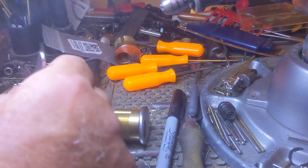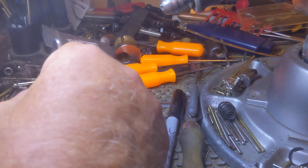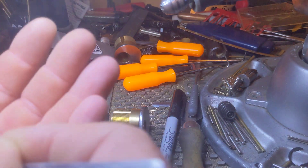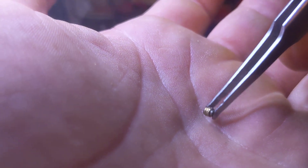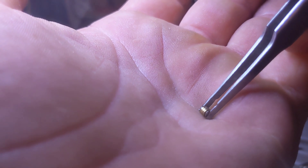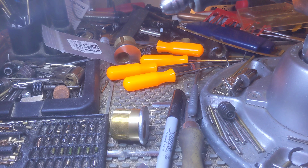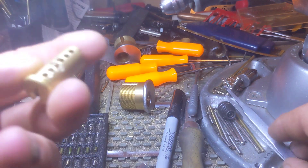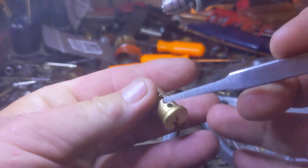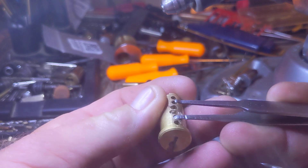For something like this, the flared edges — given the tolerances and the ability for a pin to wiggle a little bit inside that chamber — can cause that thin lip, not only of this type of a pin but even like a thin lip spool or something of that nature, to get caught in this undercutting. So essentially, now instead of having six pins, they have only one pin. Look at that beautiful undercutting there.